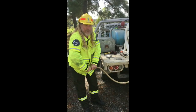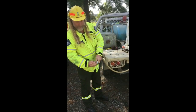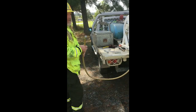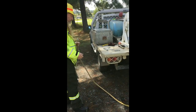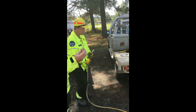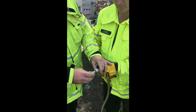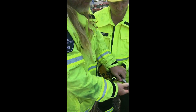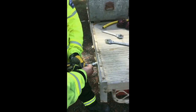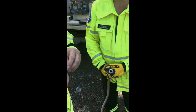You need a little bit of pressure on that, but I've got office hands and I can do it. Now that's pushed right up hard against this fitting. Now comes the difficult bit — this tail has to be pushed in there. If you've got a device in the workshop, it's quite easy, but out in the field you're going to have to put some pressure onto this. To make life a bit easier, put a bit of lube on that — get a bit of hand soap from your truck or a little bit of engine oil out of your motor.